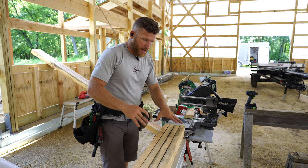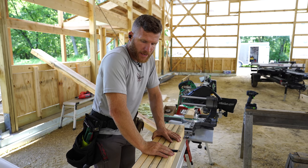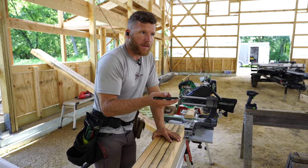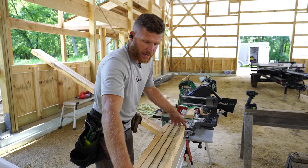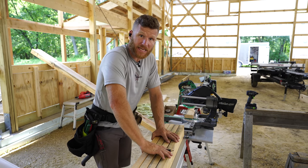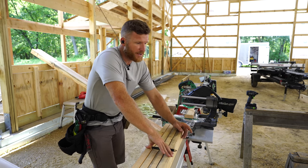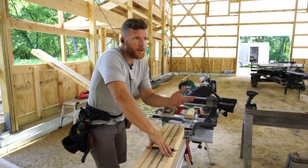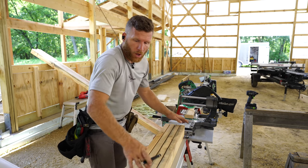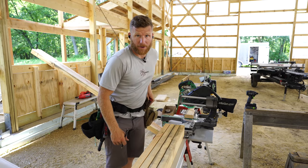That's how I like to cut my lumber. I'll measure the first one, but sometimes - especially in this instance - I'm not trying to hit an exact dimension. Yes, I want to be exact, but the important thing with framing is that I want all of my members to be the exact same. So if this one was measured at 37 and a quarter and it ends up being 37 and 5/64ths, at least all four of them are exactly off the same. Sometimes consistency is what matters.